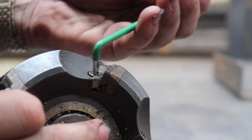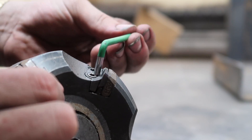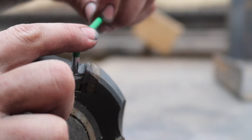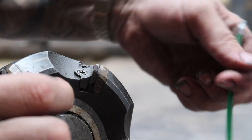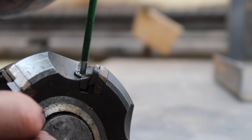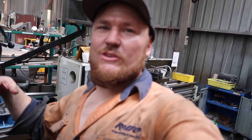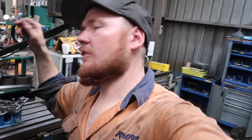I'll do a stainless TIG run first and then put some arc rods over it. The first thing I decided to do with the milling head was to turn the tungstens around - just normal tungsten carbide tips but all the tips have been really severely chipped. You just undo that screw and turn it to a decent face to cut, otherwise it would have a chattering effect. A guy at work reckoned I could run it at about 800 RPM and not use coolant so it doesn't block up, so I'll just listen to him.